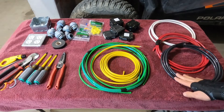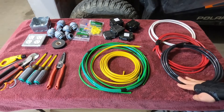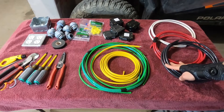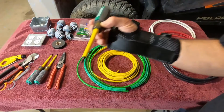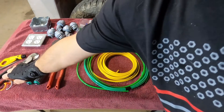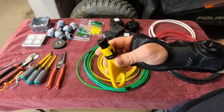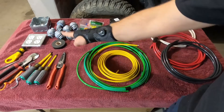These are our mains — they'll carry the power from our inverters to the subpanel. This is four gauge wire. We have our primary hot, our secondary hot, and our neutral. We're going to be pairing this with a 70 amp double pole breaker, and we have number six ground wire. You'll definitely need a number two square drive screwdriver when dealing with a panel. You might want ring nut wrenches, cable cutters, coaxial cutters for large cables, liquid tight or seal tight connectors, and some tape.